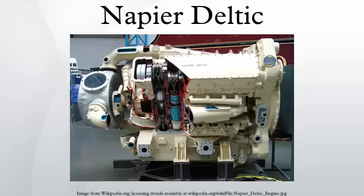The primary advantage of the design was that it led to a rather flat engine, intended to be buried in the wings of large aircraft. The Admiralty required a much more powerful engine, and knew about Junkers designs for multi-crankshaft engines of straight-six and diamond form. The Admiralty felt these would be a reasonable starting point for the larger design it required. The result was a triangle, the cylinder banks forming the sides, tipped by three crankshafts, one at each apex.